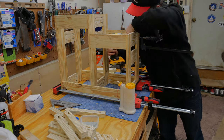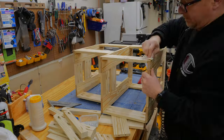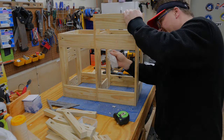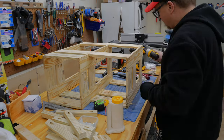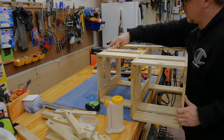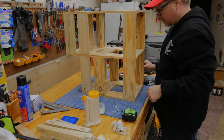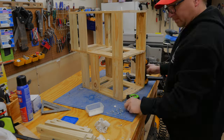After I had the basic shell of the frame complete, I spent a little time cleaning up all the glue squeeze-out from the initial assembly. I originally was going to stain this planter but ultimately decided to paint it, so removing the glue may not have been strictly necessary — but it's good practice and was fairly easy to do. After wiping down the frame, I finished the assembly by installing the remaining side rails on the lower and upper frame sides.